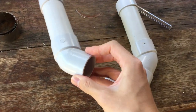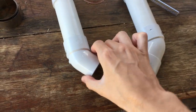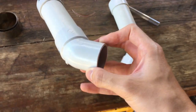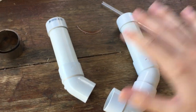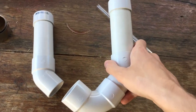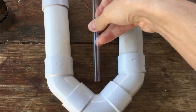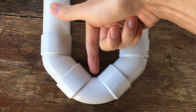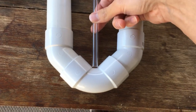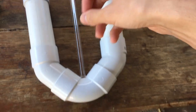To make sure the hydrogen and oxygen stay separated, I'm going to cover this part of the pipe on either side with a bit of fabric — maybe cotton or something resistant to sodium hydroxide — so that no oxygen gets into the hydrogen coming off and no hydrogen gets into the oxygen. I also thought we could drill a small hole in the top of this PVC fitting, stick a glass tube in, and this could act as the way we fill and empty it, and also show us how full the container is with water.